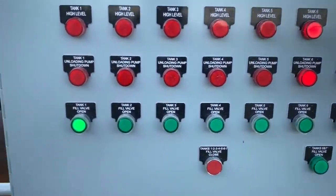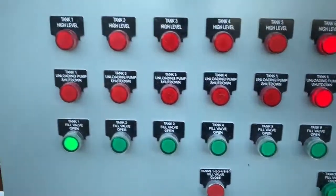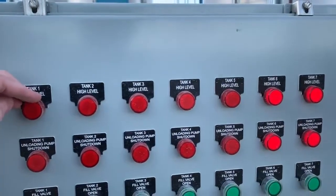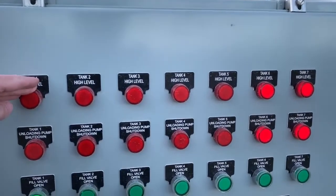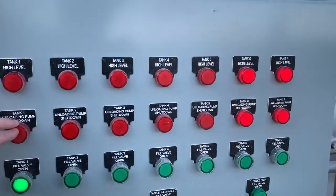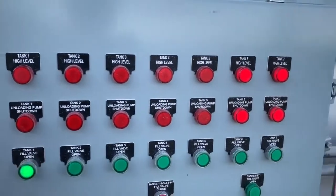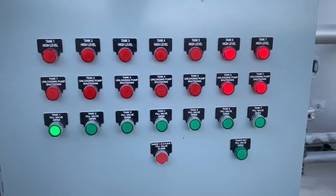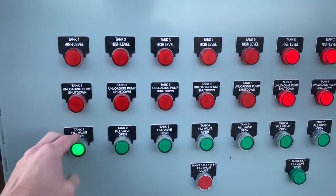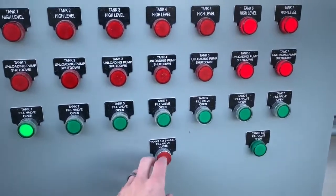We're going to start flowing. While we're unloading, I wanted to make a note about what these lights mean. You've got a lot of lights here — really the only thing that matters to you are the open buttons. When these lights come on, it means you're close to being too full, something like four feet from the top. When this light comes on, you're full and it's supposed to shut you down. We've seen many times though how sensors can go bad, so you still need to pay attention as best you can. These lights simply mean your valves are open.